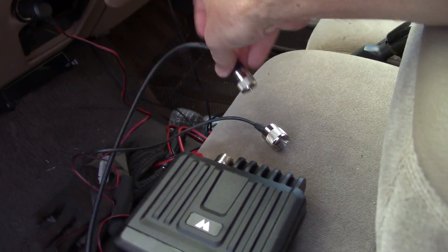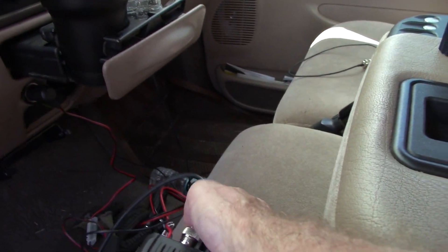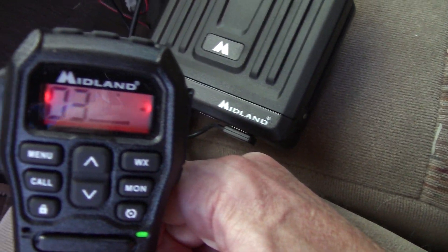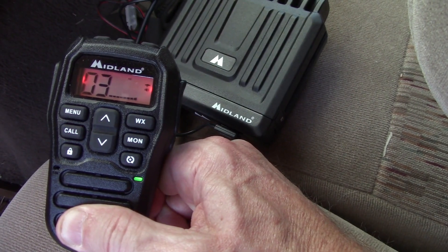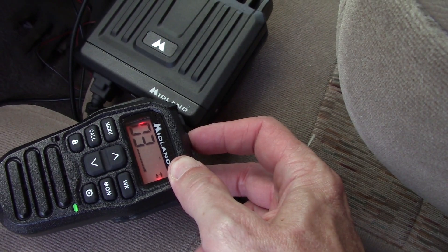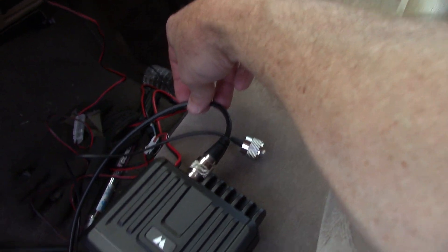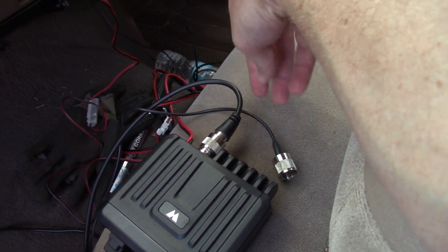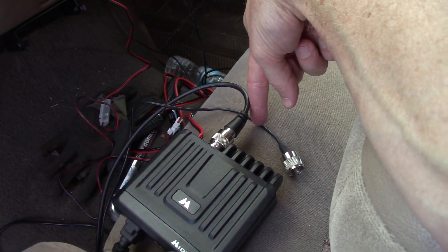Let's pull this out and put in another antenna. That cleared up quite a bit — from about three or four bars of static we went to about eight. The difference is RG58, about 17 feet of it, versus 20 feet of RG174. This translates to about a 1 dB loss versus 3.3 dB, so I've already gained 2 dB on signal.